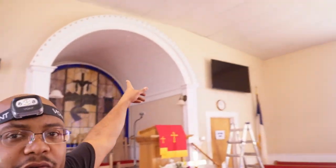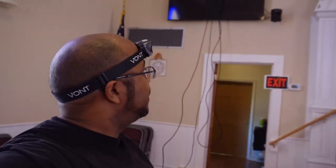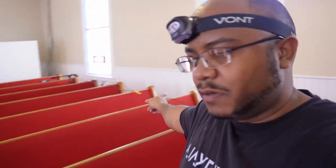Alrighty, so the 50-foot cable I already have ran over and plugged into the TV. Got plenty of slack over here. So now I'm gonna go back up in the attic, pull out that HDMI Ethernet adapter, plug in the HDMI cable that I have here on the floor right now. Make sure I get a signal. I should get a signal everywhere because this is actually split. So, I mean, that's gonna work. But I should get an image on every single TV except for this one because I don't have an adapter. We get that, we're gonna be good.